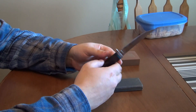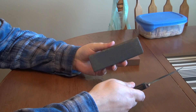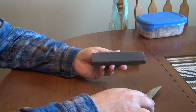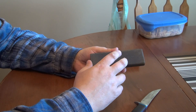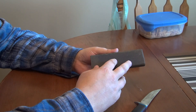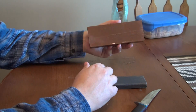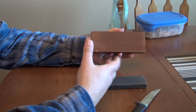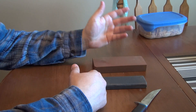The interesting thing is this. This is a very cheap stone — very non-abrasive or slow cutting. The reason is that it has a very high binder content; it doesn't release fresh abrasives very well. It's relatively coarse, but again, very slow cutting. This is a King water stone, which cuts much faster — very nice binder, which continuously releases fresh abrasives.